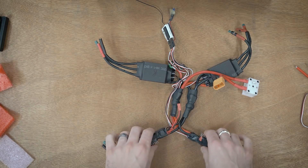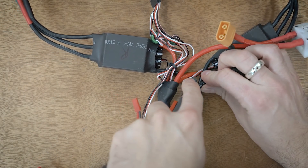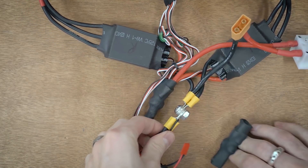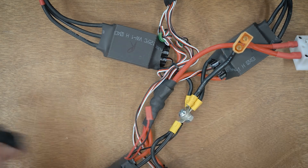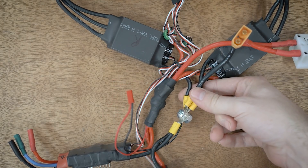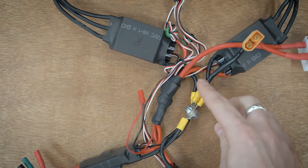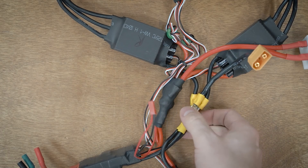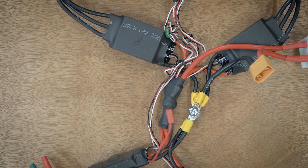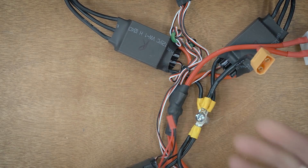For power distribution I'm going to slice these open and show you. All the wires just go into a quarter-20 bolt that was tightened down, with ring terminals, all covered in thick heat shrink. I was actually considering machining a little aluminum block that everything plugged into, but this turned out to be the most simple solution. With two of these side by side underneath the battery it was a perfect fit and there's really no way for this to break or fail in any meaningful way.